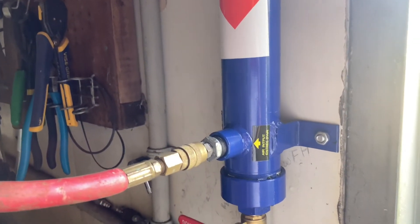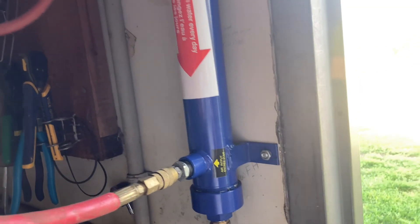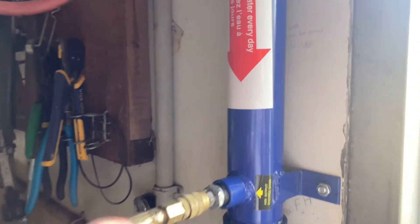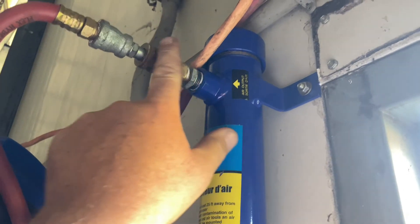Here's a quick tutorial on how this thing works. You've got your incoming air here from your air compressor. It does say on there to keep about 25 feet of line — I have 25 feet of line that feeds into this thing. Then it comes up through this tube. The air is forced through a whole bunch of desiccant — looks like little marshmallows — that you can buy from Princess Auto, and out into my hose reel.